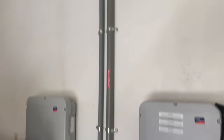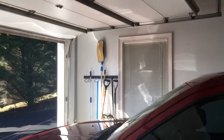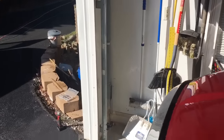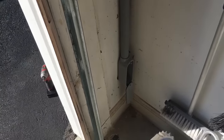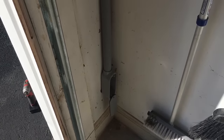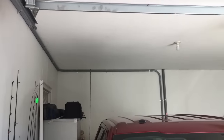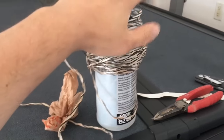Here's your trick for the week — maybe trick of the month or quarter. I've got about 60 feet of conduit going through this garage, and I'm gonna show you how to make that pull really easy when you've got PVC conduit or some type of airtight conduit. It wouldn't work with metal flex, since that's not airtight. I'm going to be sucking a string through the conduit.